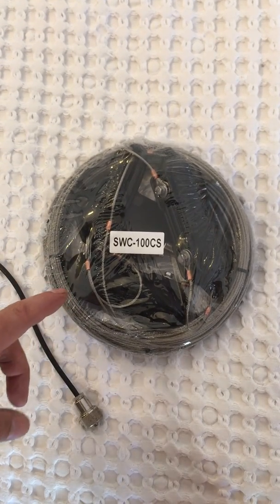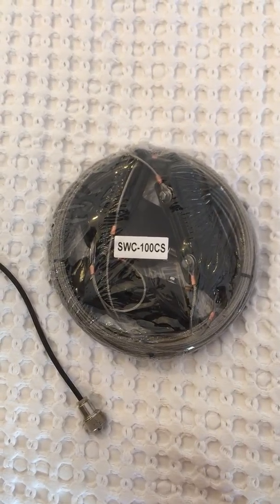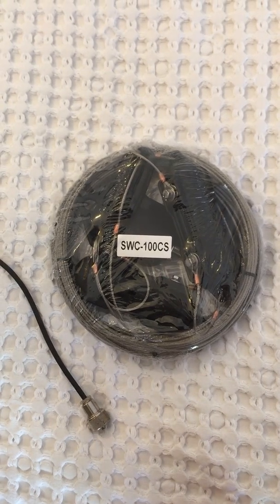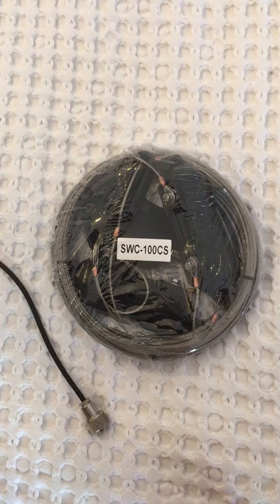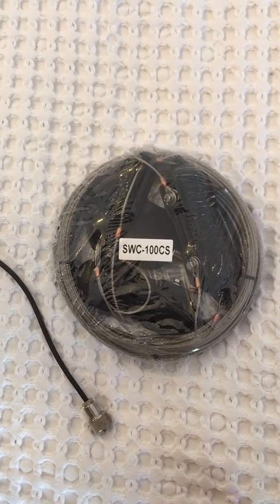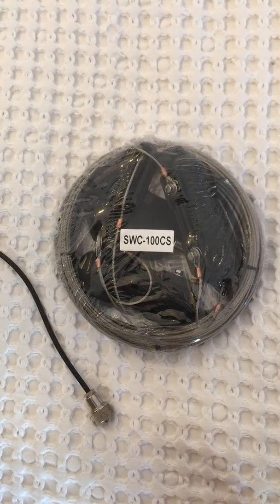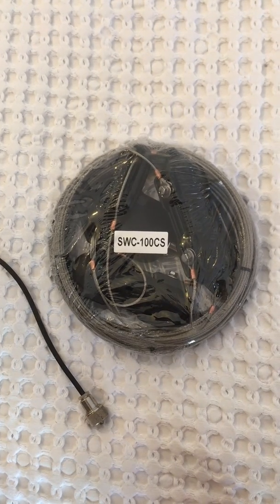This is 34 meters overall length, that's from insulator to insulator. It's a true broadband dipole, so no tuner required. The specs we put on it are 3.5 to 30 megahertz, 250 watts PEP, 100 watts continuous, and generally the VSWR is under 2:1 across the band.